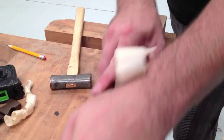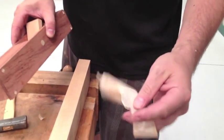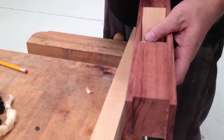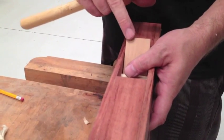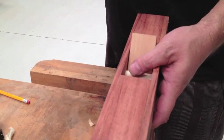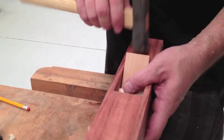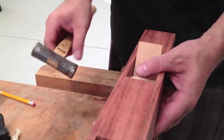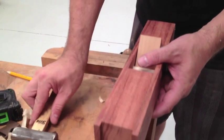As a way of testing — that's a pretty good shaving, a little thicker. If we want to undo that, we just bang around using a little metal hammer. My setup used a slightly different wedge, so I use a bigger hammer; for this one you want a finer point, maybe almost like a peen-style hammer. Tap around and you can feel when your blade slides in a little bit when you're tapping — that's kind of how you set it. That should loosen it, making it a little bit thinner.